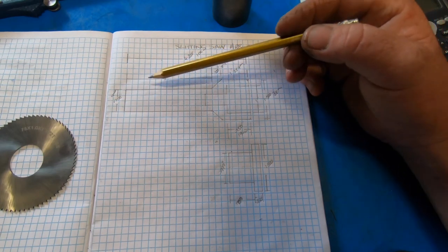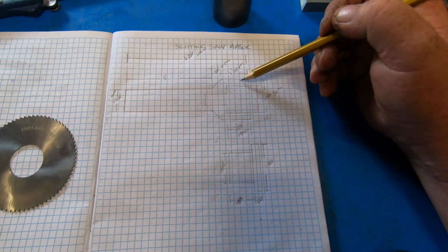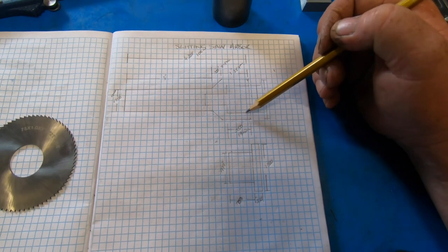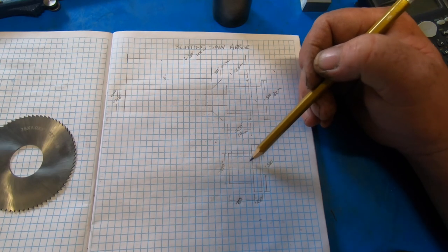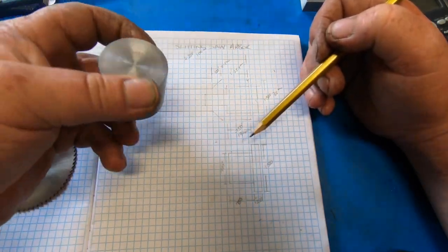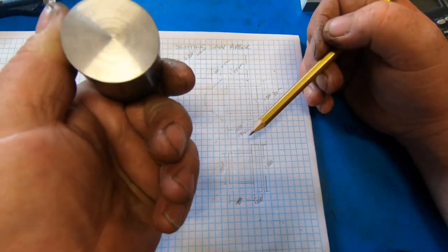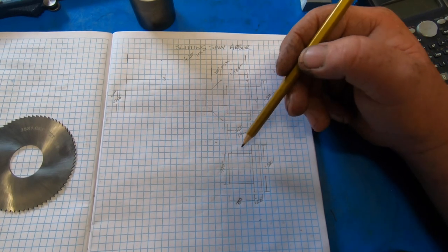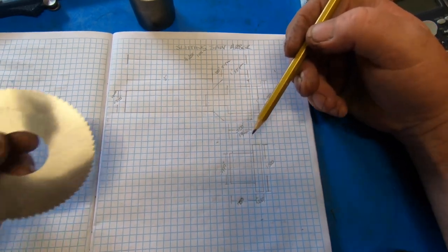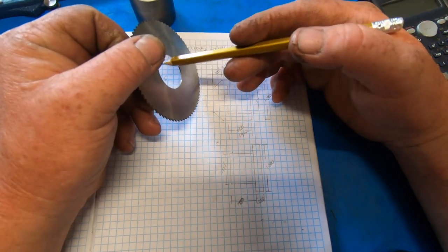So it's a 3/4 shank, 1.5 inch outside dimension here. The slug on the end, which it's a slug at the moment, it's just a piece I had left over. I just cleaned the ends up. It's got to be a really, really nice fit, so sort of 0.5 thou tolerance, if that, inside this bore.